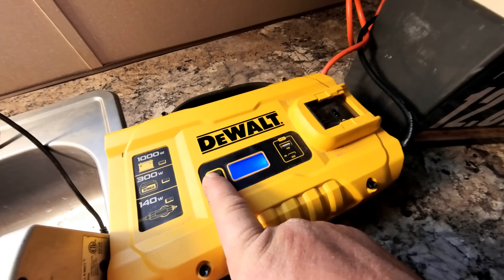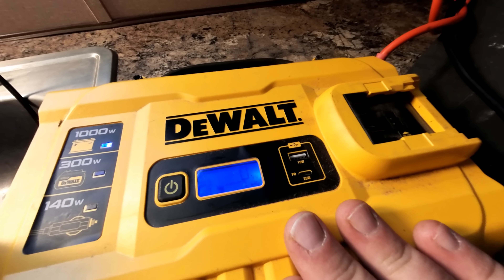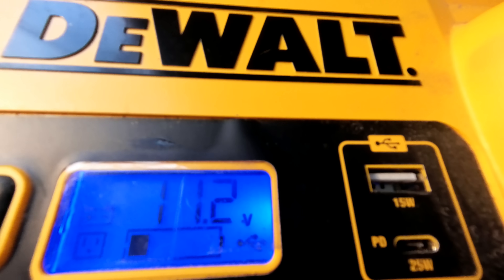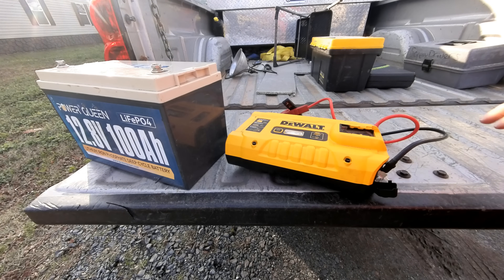That was a pretty cool test. The inverter did power back up, so my guess is when the compressor kicked on this last time it was too much power for the inverter to push. The battery voltage is now at 11.2 volts — this battery is basically completely discharged. Something like this may be a great idea for somebody who cannot afford solar panels. Having a couple pieces of equipment like this stored up for backup power could be a smart idea. You'll need a lithium battery charger to charge your battery back up after use. I'll leave links in the description for the PowerQueen battery and the DeWalt inverter. I hope you found the video interesting — go ahead and comment if you have other ideas.